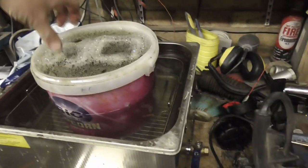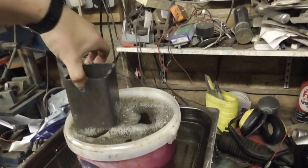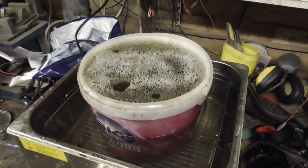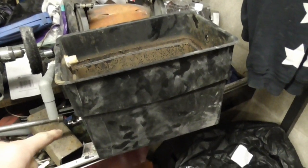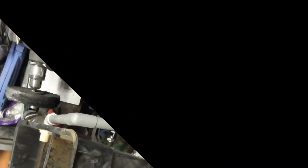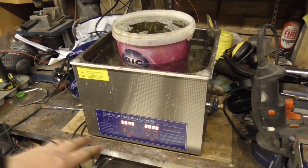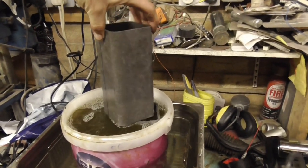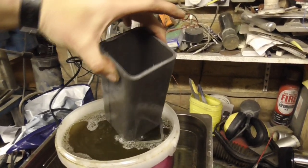It's been in for about five hours now. Look at that — check that out! It's been running for 50 minutes in total. I'm not sure, so we'll do an experiment, because I also made this today — I'm going to put a heating element on it. I'm curious to know if just heating up the citric acid speeds things up as fast as the tank does, or if the actual ultrasonics has something to do with it. After about six hours total, temperatures ranging between 40 and 50 degrees and about an hour of ultrasonic zapping — look at that, that's awesome. Back to bare metal! There are a few little bits it hasn't quite got to, but I'm really impressed by how fast it's done it.